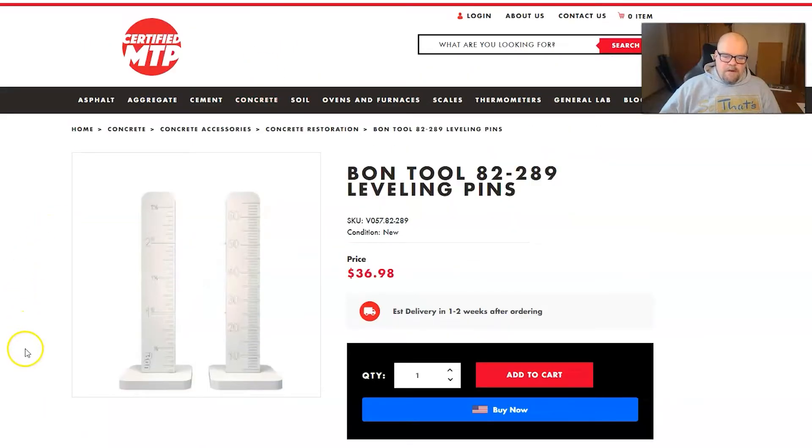Here's another thing I'd really recommend: these are called leveling pins. You can stick these on the floor where your deep spots are — put a whole bunch of them down. They stick with a self-adhesive strip underneath, and you just clip them off where you want to end your self-leveler. Find your dip, cut these where you want to be level with the rest of the floor, and they'll be a nice guide so you don't put too much or too little down.